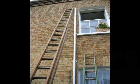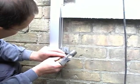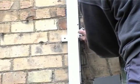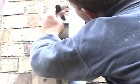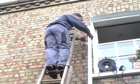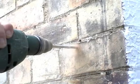Align the ladder and hang it onto the pilot screw. Make sure it hangs straight. You are now ready to mark the rest of the screw positions. With the ladder now being in the correct position, mark all of the screw positions with a centre punch. Make sure the ladder does not move in this process. When all the holes are marked, the ladder is taken off the pilot screw and kept out of the way.